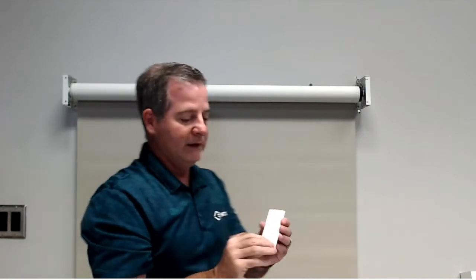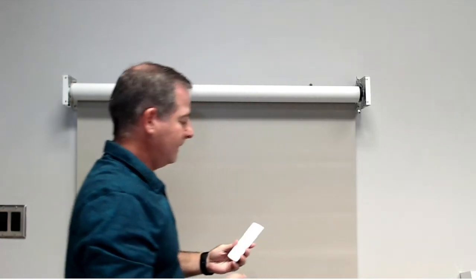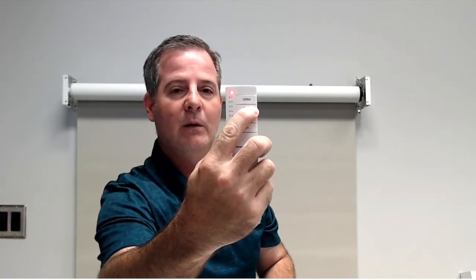And now we're going to hold the center and B button down, these two at the same time. Slow flash like before. Okay, you saw the jog. Now, the only fast flash you're looking for is to hold the stop button. We're going to hold the stop button down to get out of pairing mode, or program mode.